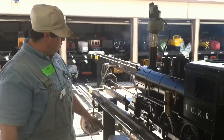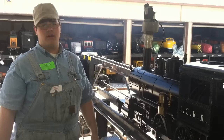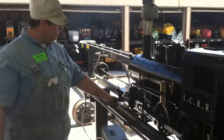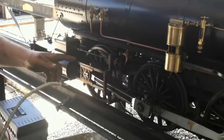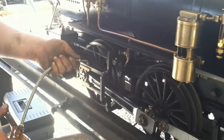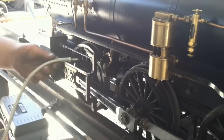While the engine is firing up, one of the things you can do is the daily chore of oiling the locomotive. Oiling the engine sometimes needs to be done multiple times during the day — it's essential to keep the engine in running order, otherwise you'll have premature wear which can be very expensive to replace later. We're going to start up here with the pilot truck, oiling the rear journals behind the wheel — there's a little oil cup right behind there. Just drop a little oil in; you don't need a lot, just enough to fill the hole. The other little oil caps are for the bearings along the side rods and for the slide valve.